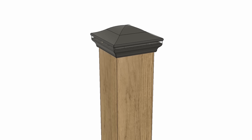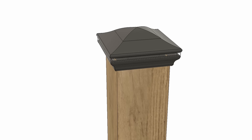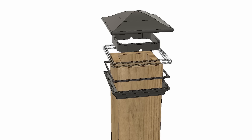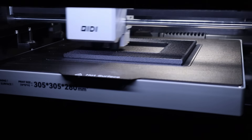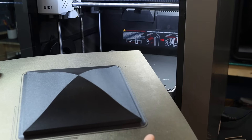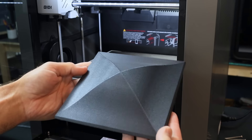I've also designed these outdoor post caps with integrated LED lights. These will eventually be painted, but I wanted something that can handle the heat of an LED light running for hours, the heat of sun beating down on it, and a big swing in temperatures. I'm going to probably use ABS for the final product, but I wanted to give the PPS carbon fiber another go on this printer. These are meant to be wired using outdoor LED lights through a cavity in the post, and I'm also going to make a matching set of recessed lights to shine down on the steps and deck of the porch I'm building.